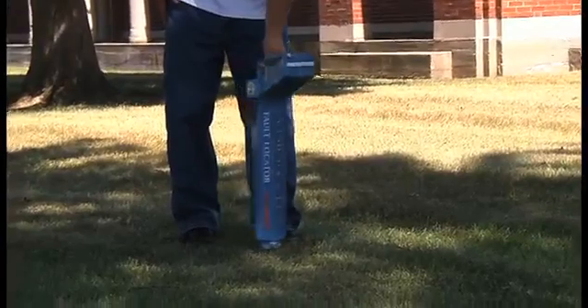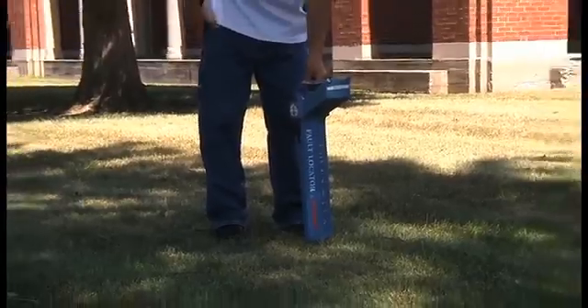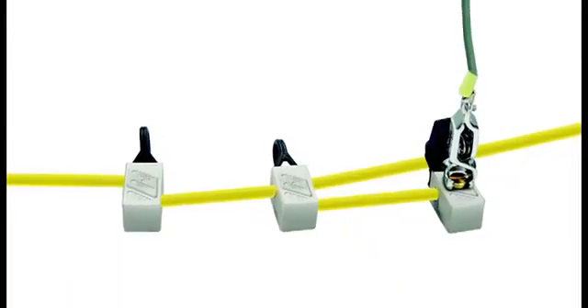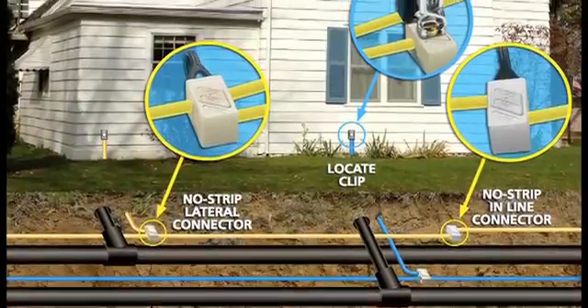The run of the wires is approximately 330 feet. What we found was, in virtually every case, the 19-gauge wire inside the TraceSafe gave higher signal strength readings than at comparable sites on the 12-gauge copper, and this held true for each of the four frequencies. I'm thankful for NEPCO giving me the opportunity to look at something like this. We're platform neutral and independent — we tell it like it is, and we set up the testing so that both the 12-gauge copper and the TraceSafe would be tested under identical conditions. Ultimately, this new system allows you to locate your lines faster and easier than ever before, with greater accuracy and the highest level of water blocking ever.